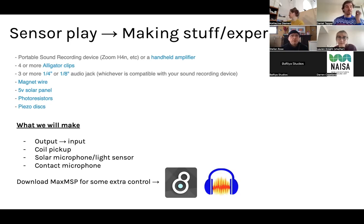You can use them later as tools. But just make sure to have your wire, and something to strip the wire with. I've just got scissors, nothing fancy. If you have a cigarette lighter, that's a really good way of removing the enamel. If you don't, use something that will rub off that enamel, ideally sandpaper, but if not, you can go like I used to and use a serrated knife to scrub it, or a nail file will do.